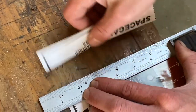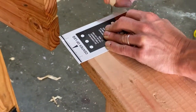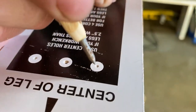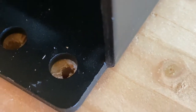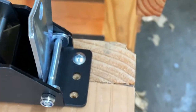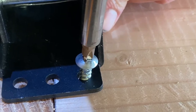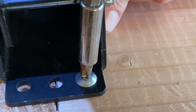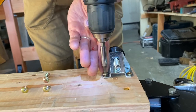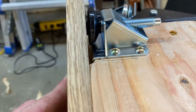I'll leave a link in the description — I've bought this style of caster twice already. I got these on Amazon for around $26 to $30. They allow you to use feet on your workbenches and just flip the casters down when you want to roll it, so they're completely out of the way and your work tables aren't rolling around on casters while you're trying to lock them in place. The adjustable feet are super great as well. If you have something heavy like a bandsaw, all you do is take an Allen bit with a drill and you can move your super heavy bench with almost no effort.